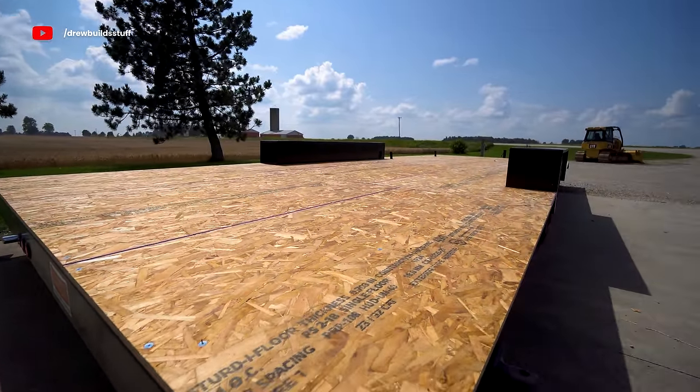And here's a good clip of how that bent over tab kind of seals up that gap between the 2 pieces of trim and allows as little water as possible to go through. And that's how you trim a window for siding, and the same way you trim pretty much everything else on here. Siding will never be 100% waterproof, and there's always house wrap to catch anything that does make it through the little gaps.